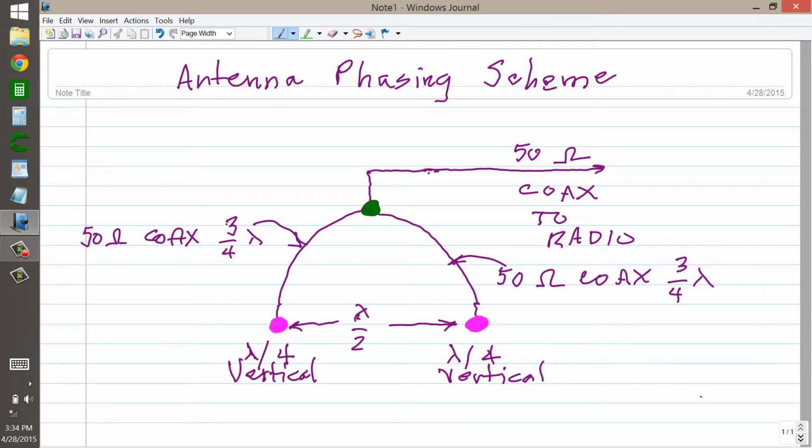Now in free space you don't use a velocity factor. A half a wavelength, I believe, is something like 492 divided by the frequency in megahertz, and that's the figure in feet. For a half a wavelength, and I'm using 40 meters as an example, that would be something on the order of 70 feet. You'd have to calculate it for yourself. I'm not going to waste any time here doing it, just dividing 492 by your favorite 40-meter frequency.